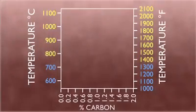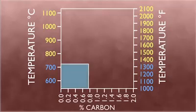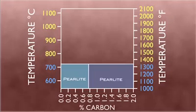At lower temperatures, ranging from 1335 degrees Fahrenheit and below, the steel will exhibit the crystalline form of pearlite. In this state, the steel has very high strength, hardness, and toughness. We aim for a good middle ground combination in the final product. The atoms will not be too hard or soft, but just right.